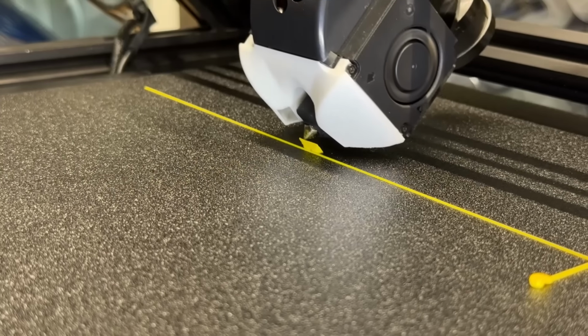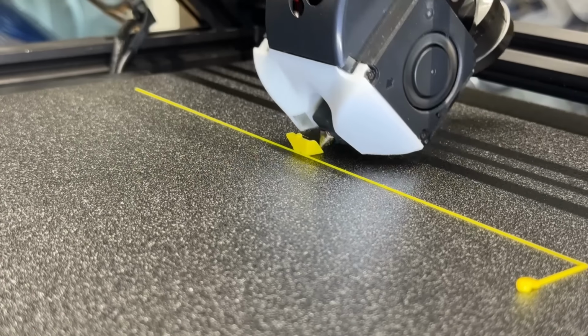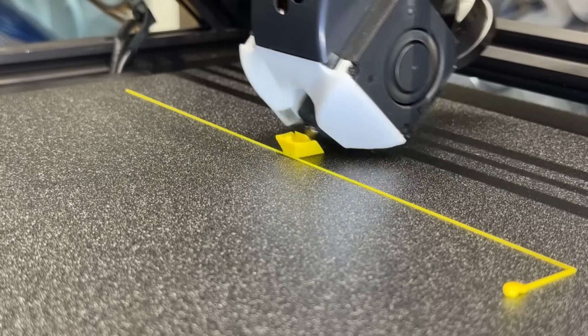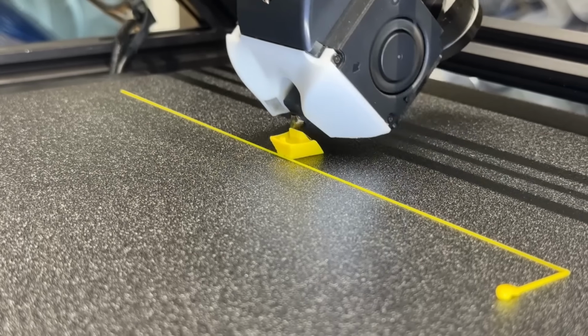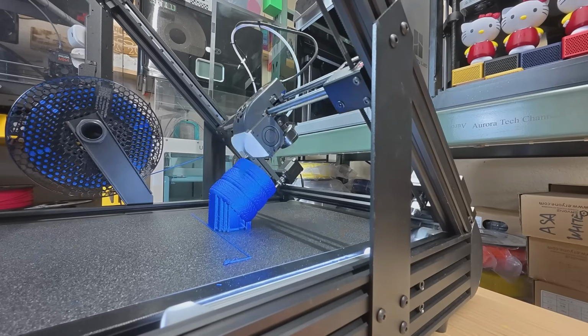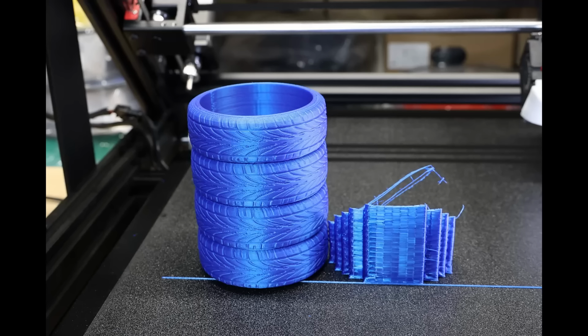5. The PEI belt is working great. When printing small objects, the default profile of 65 degrees Celsius isn't enough, but once I raised it to 75 degrees Celsius, I didn't have any failed prints. Even for printing a 45 degree tilted model, it sticks very well from beginning to end. I can just snap the model off the support materials, which still stick well to the bed when it's hot.